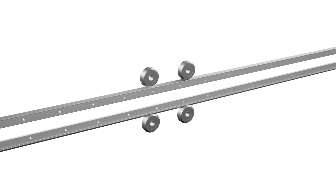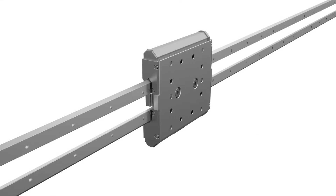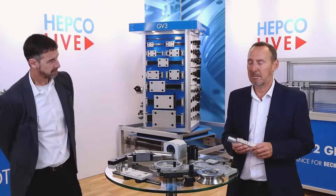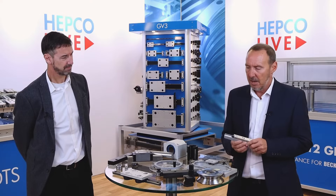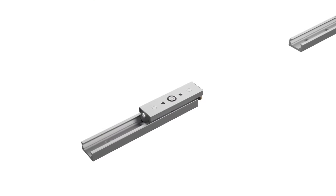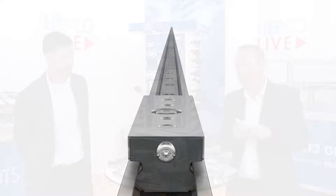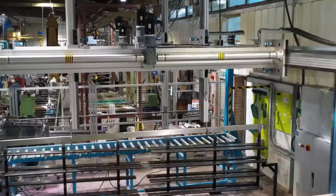You've got component-based solutions — dual V, for example, if you want to spread the rails further apart, they can be easily mounted onto a square corner, giving greater design flexibility. And of course, with so many different types of requirements across a range of industries, envelope restrictions may require a system where the V bearings are actually mounted inside the track rather than outside, lessening the width and making it much more suitable for confined envelopes.